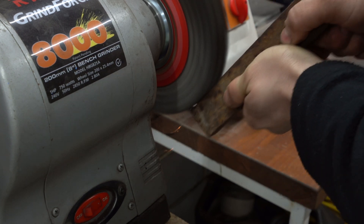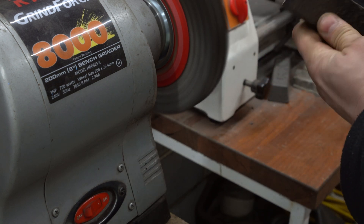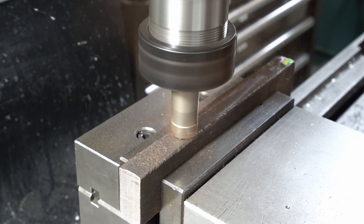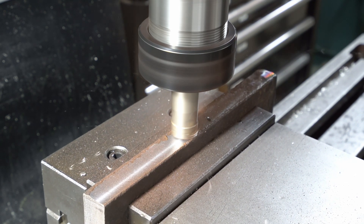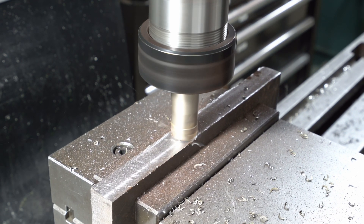To save my cutters on the mill, I'll brush off as much rust as I can. I'm debarking it using a 2-flute indexable carbide end mill — basically this is a small diameter face mill. When I'm debarking something this rusty, I want to make sure I'm using carbide and going gently, getting underneath the rust with a good sized cut but a slow to moderate feed rate.